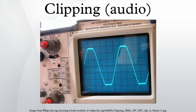Many electric guitar players intentionally overdrive their guitar amplifiers to cause clipping in order to get a desired sound. Amplifiers have voltage, current and thermal limits. Clipping may occur due to limitations in the power supply or the output stage. Some amplifiers are able to deliver peak power without clipping for short durations before energy stored in the power supply is depleted or the amplifier begins to overheat.